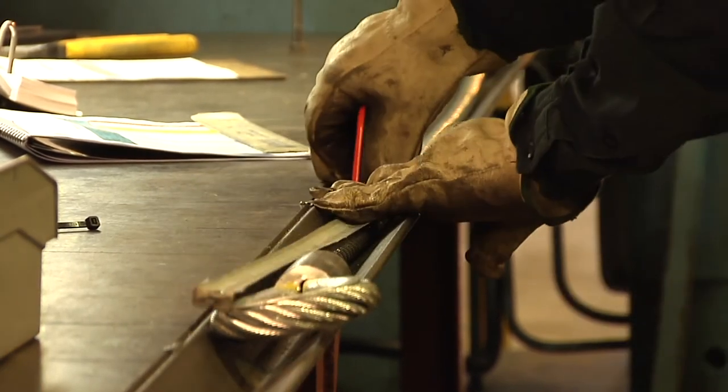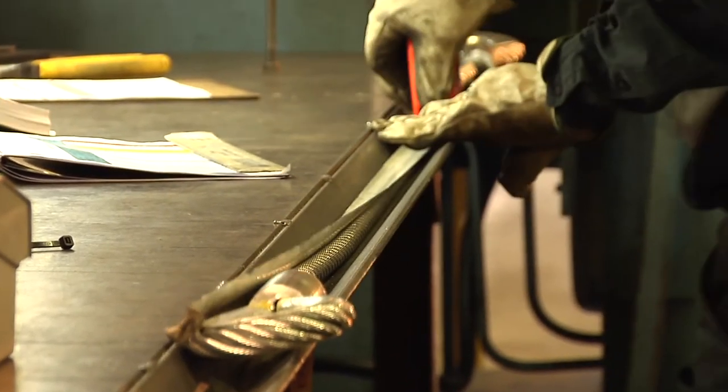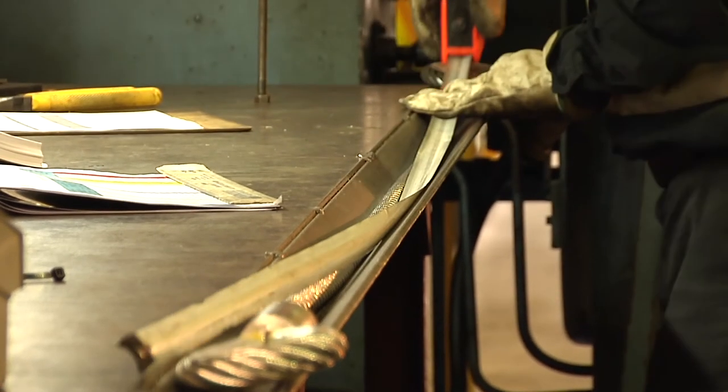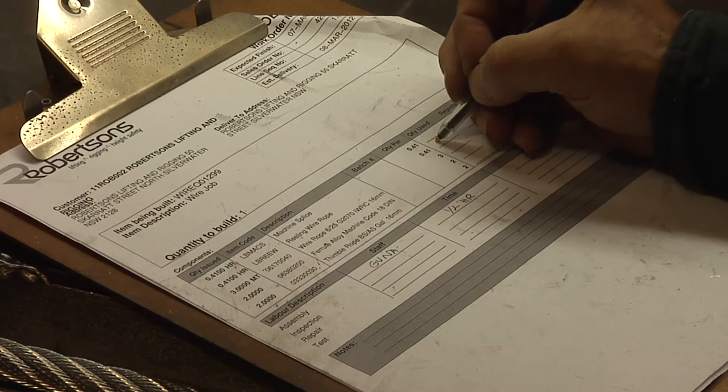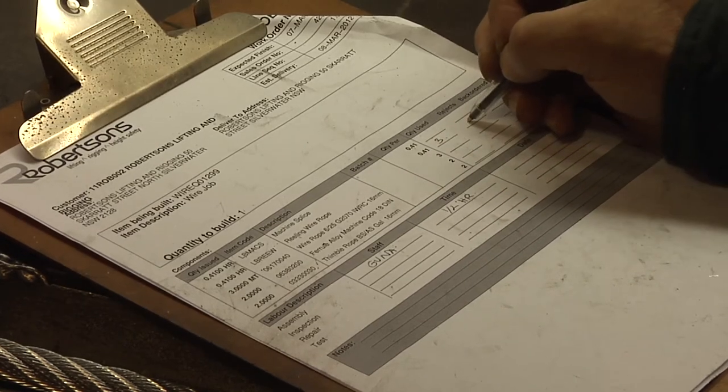If it's too long or so big that it's impractical to measure, double-check your calculations instead. If there's any doubt, ask a manager. When you have inspected everything and are satisfied with the completed job, send the unit to the test department for proof testing and stamping.